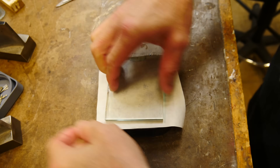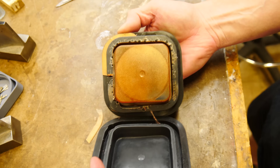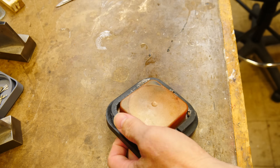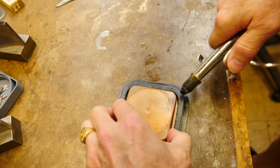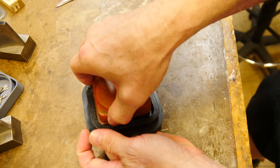The part is cured in a heated pressure tank, as always, so we don't have any bubbles. I'm using some compressed air here to help pull the resin part out of the mold, which reduces some of the stress on the silicone — I want the silicone mold to last.